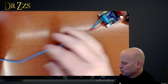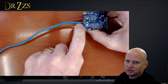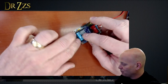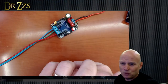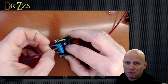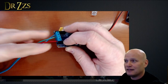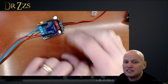Imagine you've got 10 amps of draw. The data wire carries very low current, but the plus and minus wires carry that full 10 amps. If you add a second pair of power wires, they split the current — five amps each — and the wires run much cooler. If you split the data wire, all runs will be mirrored doing the same thing. If you split the power wire, it boosts voltage at a point in the strip and splits the return current. The dig uno's circuit board traces are engineered to handle 15 amps.